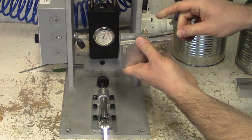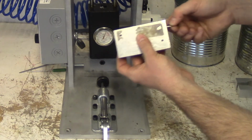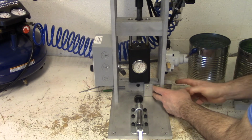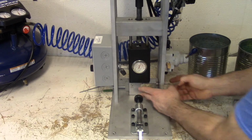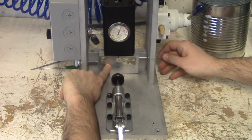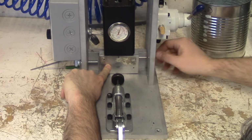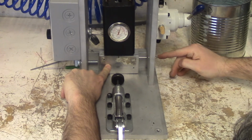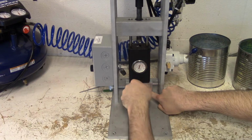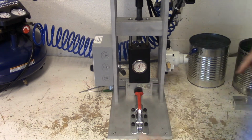Let's line up our indexing pins. And that can be loose in there for now. I'm going to put this in from the side, and again doing my best to line up my sprue with my injection nozzle. I'm going to push my screwdriver bit till I feel it hit the back. I'm going to pull it till I feel it hit the front. I'm going to go about halfway. Then we're going to take a look at our clamping pressure. Should hear it detent down, and it does.